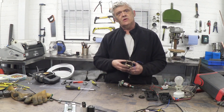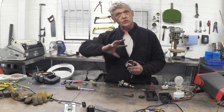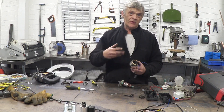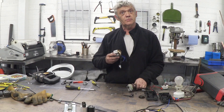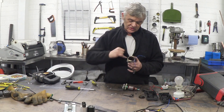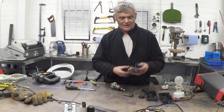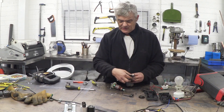We can make these into generators using the same ideas as an alternator. In an alternator, slip rings feed DC into the rotor making it one big electromagnet, which rotates inside coils to produce AC. We can swap that over: feed a DC current into the stator coils to make an electromagnet, spin the rotor, and the brushes will pick up AC output. It matters which way around they go — one end needs to be north and the other south, staying constantly north and south while the rotor spins. Handily the wires are coloured black and blue, and we want to snip those off somewhere sensible because the brushes are going to be the AC collection point.